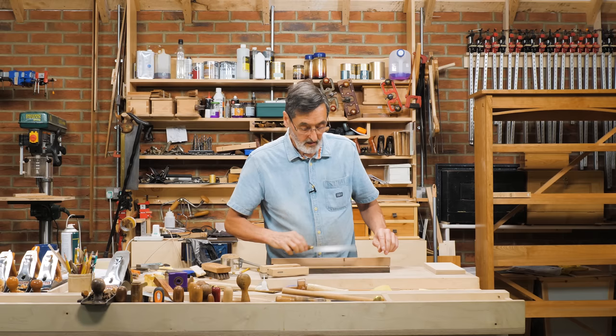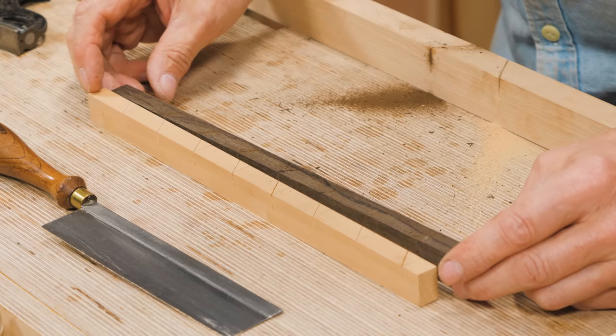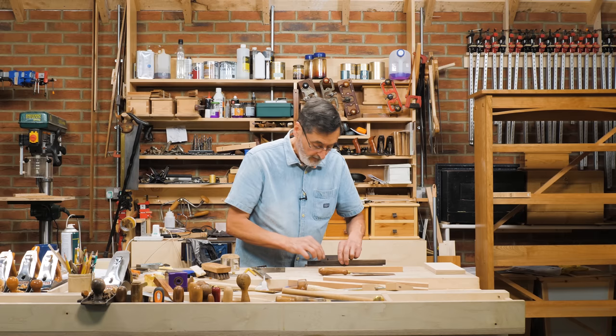So, inch and a half between these points. Even with the mitre box, make sure — see, I'm going deep on this side so that it's guiding my saw for perpendicularity. And if it's slightly off, it doesn't make much difference, I've noticed. One of the difficulties I think with this is that you often can't see which part you want to keep and which part you want to throw away. But don't worry about that for now. The next step is going to be the long cuts, so we abandon the mitre box now.